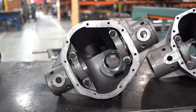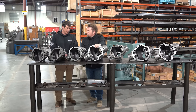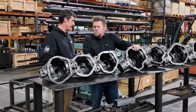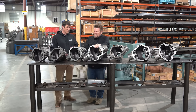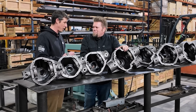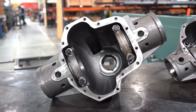This is obviously the rear version of that. It takes an 8.9-inch rear gear like a JK would, and three-and-a-quarter-inch tube on this one. We increase the tube size in the rear because they see a little bit more abuse in the back. It's a good stock replacement and/or upgrade — like if you have a TJ with a Dana 35 that's bad. You could go to the junkyard and try to find a good one, but there aren't any — they're all bad. We can build you a new 44. If you're not doing anything crazy, running a 35-inch tire, this is the perfect replacement axle versus trying to band-aid a junkyard axle back together.